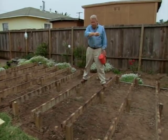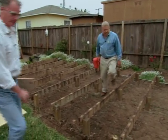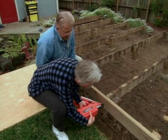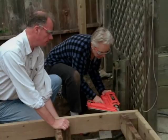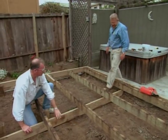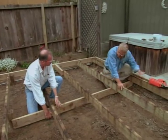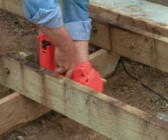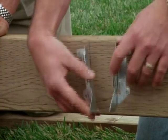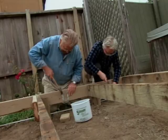In order to do that, we're going to have to put a rim joist around the outside. This is pressure-treated 2x6, and we're going to nail this right on the ends of the existing joists. We attach the rim joist with a butane-powered nail gun. The distance is just too great for a 2x6 joist to span, so we'll put a support rail in the center, holding it in contact with the bottom of the existing joist and nailing it to the sides of the post. Next, we center these metal joist hangers between each of the existing joists, then attach them to the rim joist with rust-proof, galvanized hanger nails.